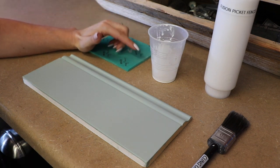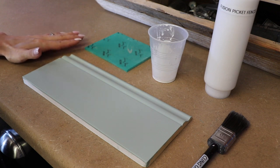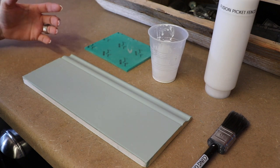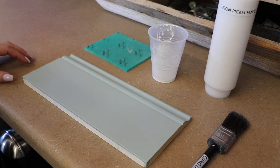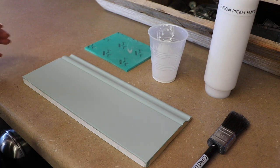How do you mix a wash? Basically, it's up to you how heavy you want it. What I mixed was about 75% water and 25% paint. That seems so thin, but that's the idea. If you wanted a heavier look, you could do a 50-50. I really wanted a very subtle look, so I went 75-25. I'll list this in the comments below. Just keep in mind you can mix however you want — I'd suggest trying it out on a sample before applying it to a piece, so you can test and measure your whitewash mixture.